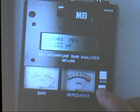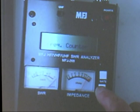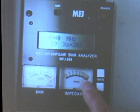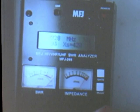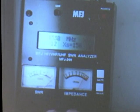Let me go back to the main mode — just keep pushing it. You can see R and you can see X. You can also see the impedance meters here. I'm just going to turn the knob, go up in frequency. Just keep turning it until you watch the R here, the X here, and the meter here until they start to go to zero.